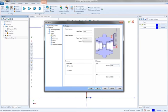Now I also like to do a distance afterwards, because when it hits the center, if I let it stop right when it hits the center, it's going to leave that little nub on there. So I could go in and say add another 1/8 inch or whatever's going to get me past. This isn't perfect. I could go probably a lot smaller than that because I'm going to be running pretty well a 64th or a 32nd radius. So I just got to go past it by enough to clear that off. I'm all right with an 1/8 inch.